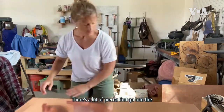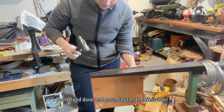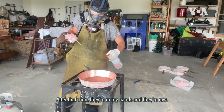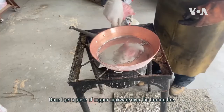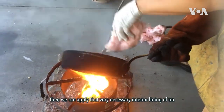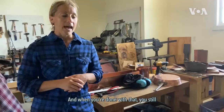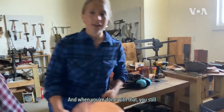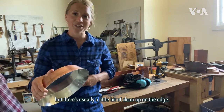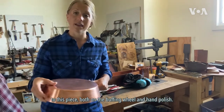There's a lot of pieces that go into the elongation and the heat treatment — that's all poured, done, and ground out on the west coast and then shipped back here to Wisconsin. After that, they're in my hands and they're raw. I have to prepare them. Once I get a piece of copper cookware over the tinning fire, I can apply that very necessary interior lining of tin, which will make the cookware food safe. When you're done with that, you still have a beautiful piece of cookware, but there's usually a little bit of cleanup on the edge and some polishing that needs to happen, both on the buffing wheel and by hand.